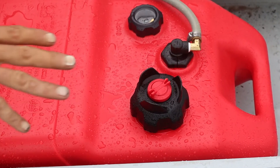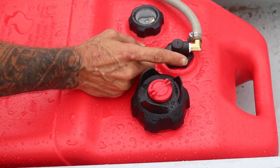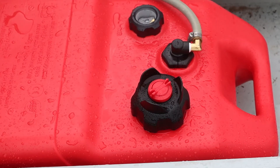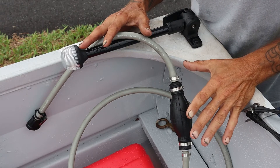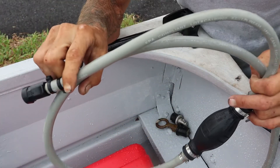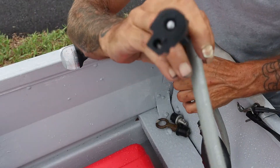Back to my new tank. What you see came with the tank, except it only came with this connector — it did not come with the little brass fitting. The brass fitting is a quarter-inch male thread that goes into the outtake of the tank and connects to a three-eighths barb, which I had to buy separately. As for the fuel line with primer ball — that's expensive, but I got it with the motor. You have to find the correct fitting that matches your outboard motor; these are not plug and play. Luckily, the seller included the right fitting, which is an $80 value by itself.